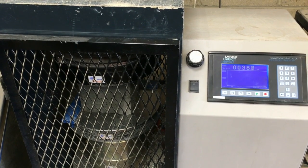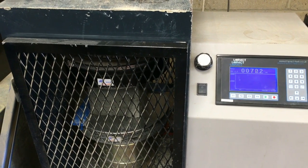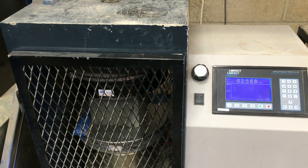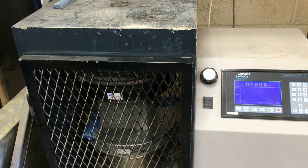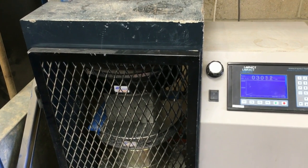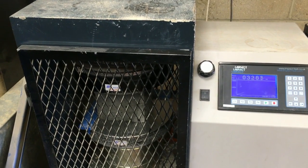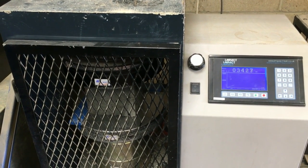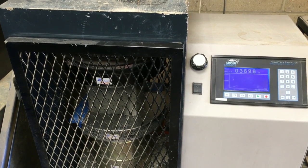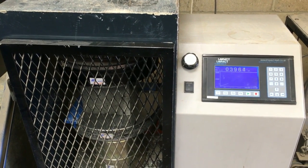So the load is now being applied to the top of the block. It just adds the weight and the pressure at a constant rate. The concrete deforms — it's slightly plastic, as many things are. You don't expect it to be, but it is. And so as it's deforming, the load is kind of catching up with it. It's always a constant load based on what it's measuring.